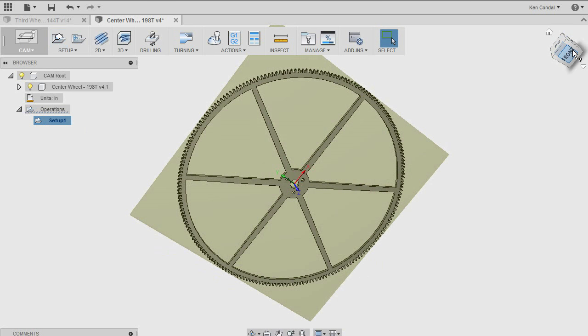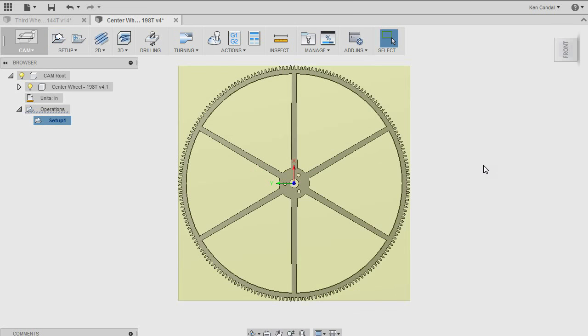So once that setup is done, now we can start to talk about how we're actually going to remove the stock. If I were doing this by hand, I would probably take a saw of some sort, a reciprocating saw, and I would just cut these pieces out and then file them to the line. So you would think that if I was going to use CNC, I could just take an end mill, which is just a cutting tool, and run it along the border here